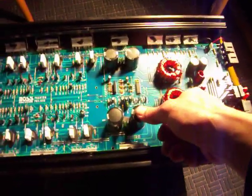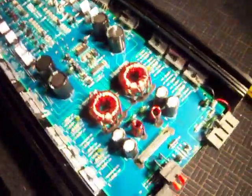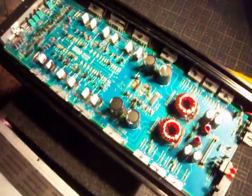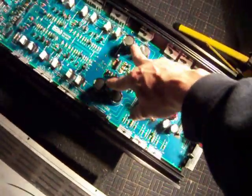As you can see, it's not terrible. It's a class AB amp so it's got a larger layout design. I wanted to compare it to some other amps — I've got a picture of my Soundstream 700.2 pulled up on my computer. That one's got eight caps, plus four back here along with two coils. This Boss has two coils, four caps back here, four caps up front. The Soundstream is a true 700 RMS rated amp, so that gives you an idea.